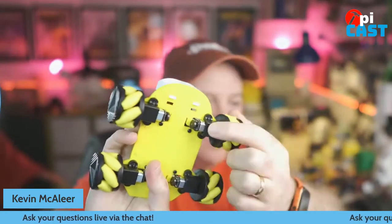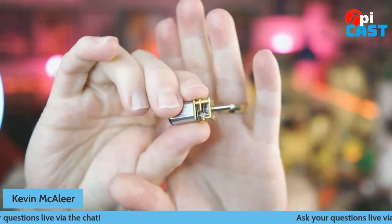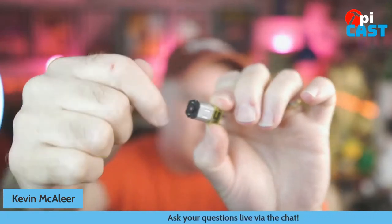Most recently, another variant similar to Explorer, but this one has mecanum wheels so it can move sideways. It has a much more interesting design for the range finder. The motors on this one have encoders on the end so you can move very accurately. Those are Pimoroni motors — the N20s with an extended spindle and an encoder wheel with a little circuit board on the back. I covered that in the last live show I did — all about Explorer and how those encoders work. Mecanum wheels are awesome.